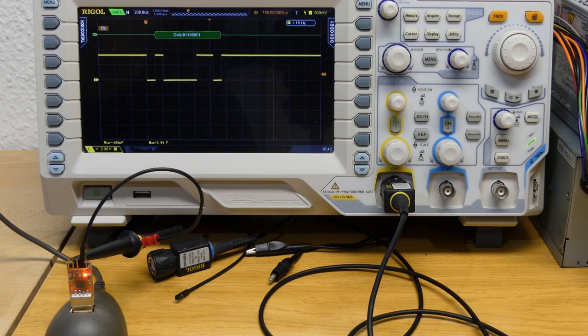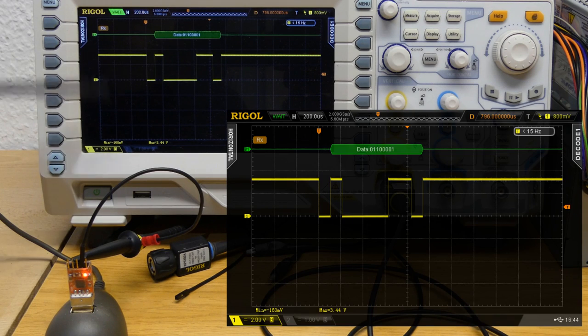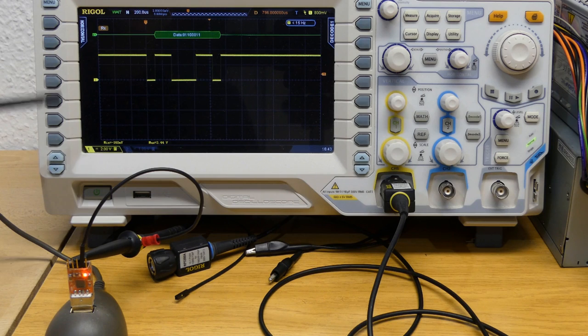What is RS-485? It's a serial data transmission protocol defined at the physical level. To illustrate: here we have a USB-to-UART converter. UART is something you've probably heard about if you're working with electronic devices. I've connected it to the oscilloscope and we can see the traffic. It is idle high, and when it wants to send data it goes low for 0 and high for 1. The data bits decoded from the transmission protocol are shown on top — one bit after another, which is why it's called a serial protocol. The voltage is between 0 V and 3.3 V, and UART is often used to communicate between microcontrollers or peripherals on the same board.